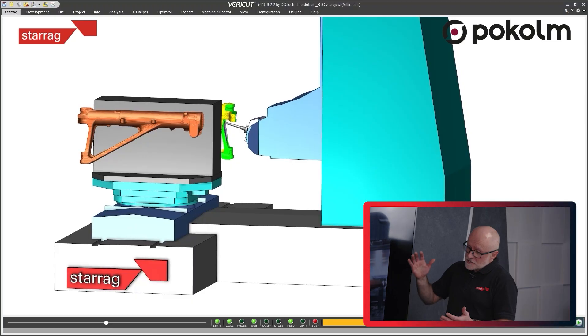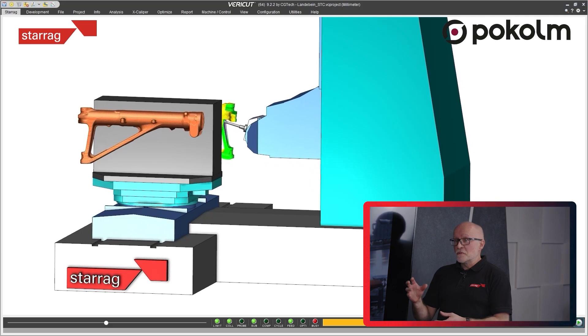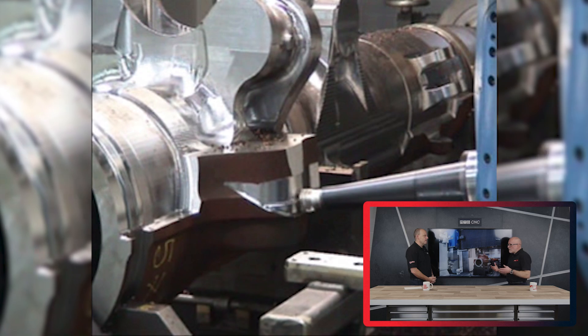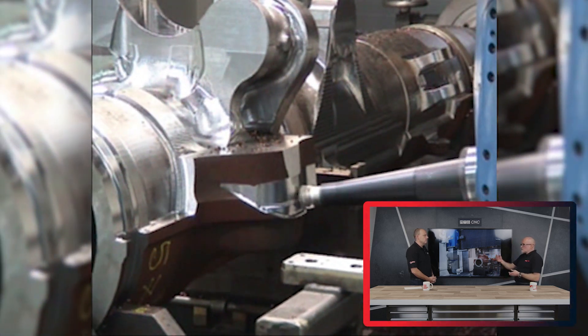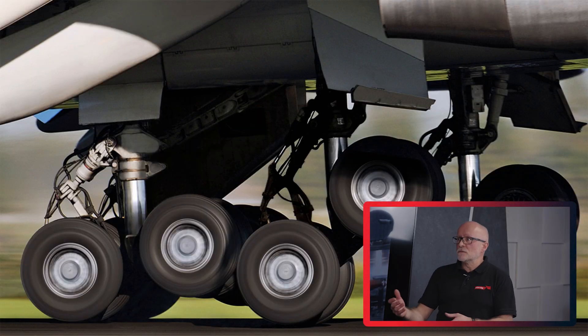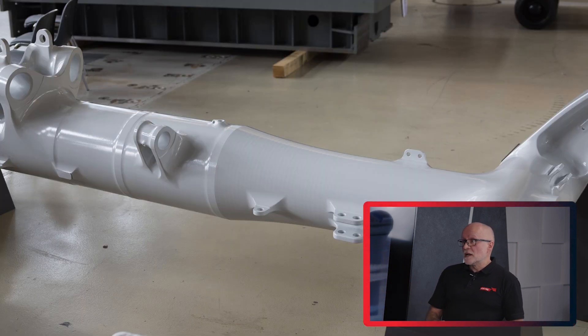Well, first of all, it's an absolutely critical part of the aircraft. When you look at an aircraft and you look at the number of people on it, the amount of luggage, the weight of the aircraft itself, and it's going to hit the ground hard - that piece of equipment's got a big job to do, so it's got to be right. The materials that landing gear systems are made of are very tough, resilient materials. We've talked about titanium in the past. Landing gear tends to be made from a different grade of titanium than your ribs and brackets are made of, and it's also made from steels as well.